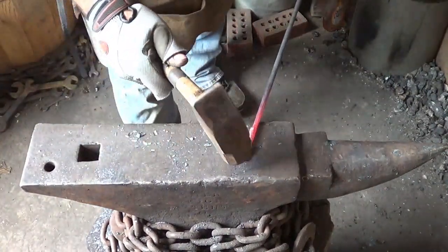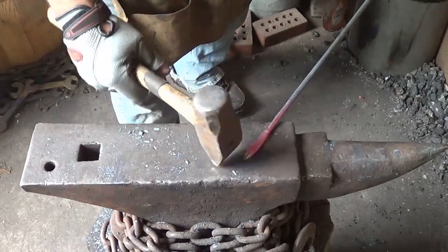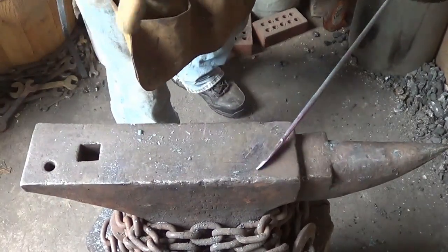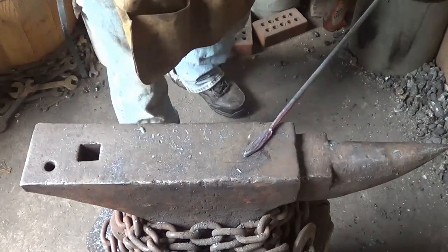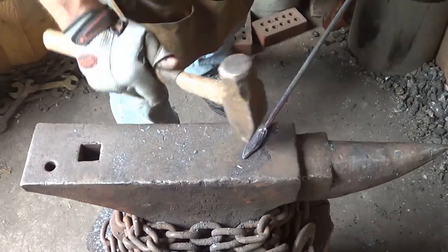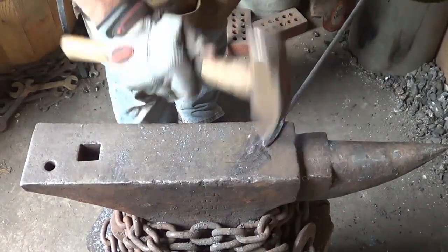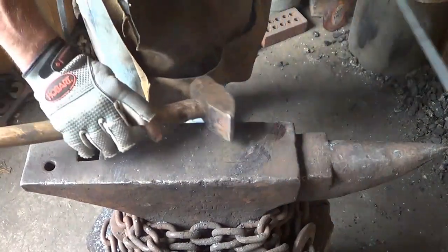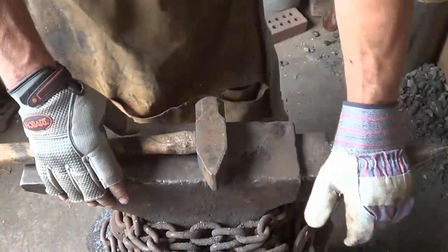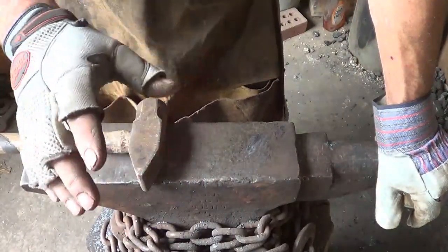When you come back you'll find where your center is going to be and you start stretching that out. Just stretch that out, or get the peens in there, go back to the heat, and try to get that done in two heats. Form the leaf — first stretch — and then flatten it all out in the second heat. Hopefully in that second heat you're also able to put the lines in for the leaf.